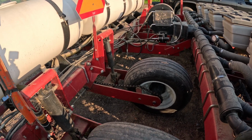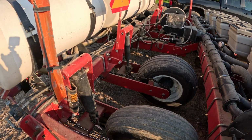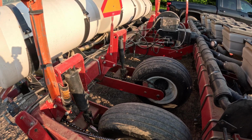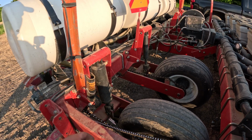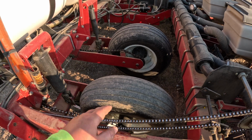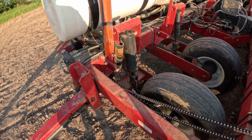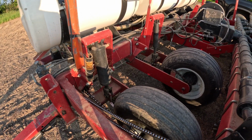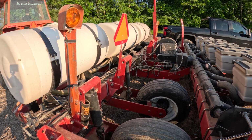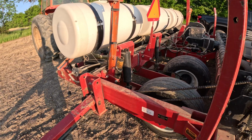But, you know, shoot, just put a contact wheel there and one down there, and this whole planter would be much simpler. And if you got a couple springs on that contact wheel, if that tire happens to drop down or go up, it's all under spring loaded tension. This thing here, all those slip clutches, just more to go wrong. I like simplicity on my farm, or I try to. And I'm not bashing a White planter. I do like a White planter.